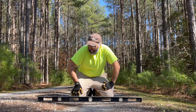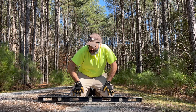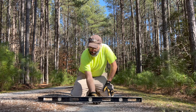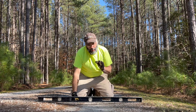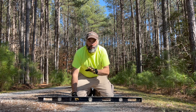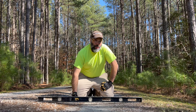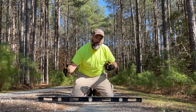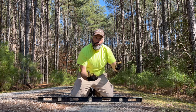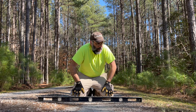And basically what I'm going to do today is bring in some additional crusher run material and use the box blade to spread it and smooth it out and basically fill in this low spot. If this had been a new driveway where this started happening soon after it was installed, one thing you could do instead of using a box blade, you could take a rear scraper blade and angle it so that when you ran the tractor down along the shoulder, it windrowed or pushed the gravel back up into this travel rut towards the crown.